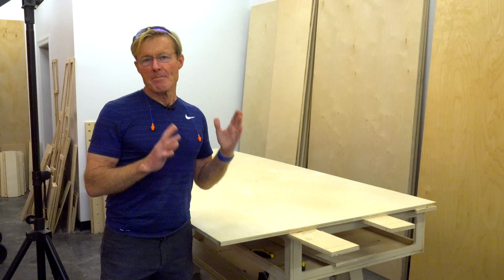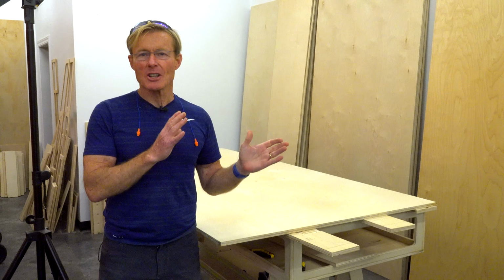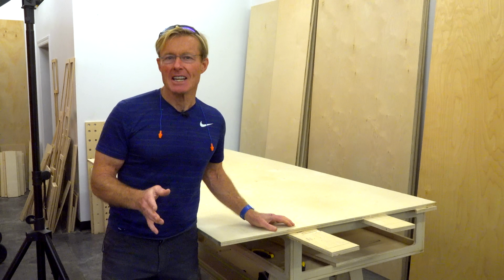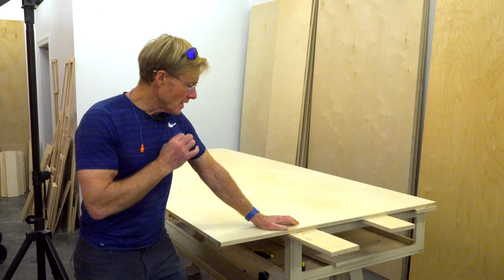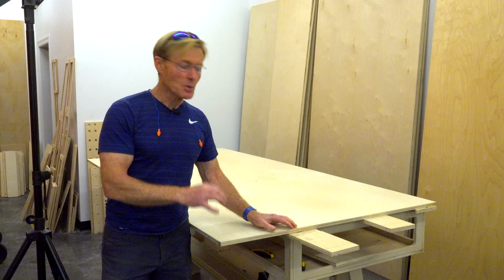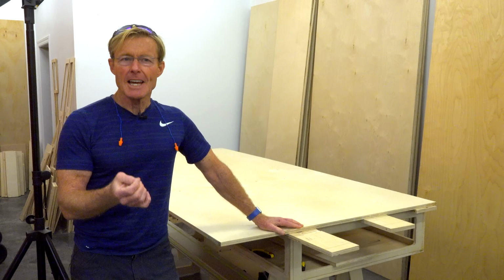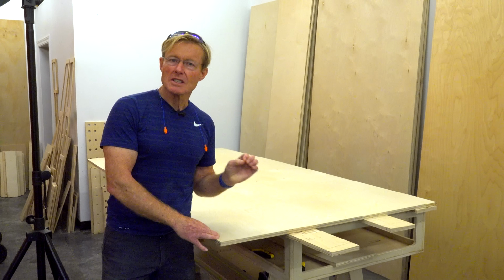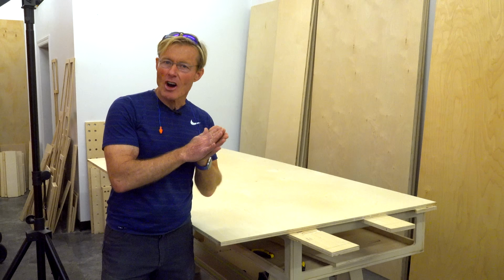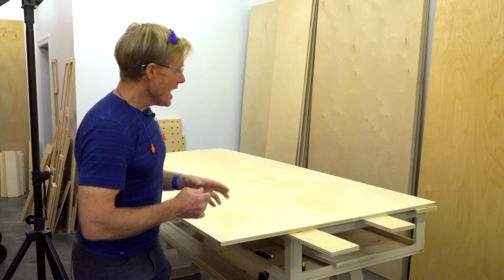I use plywood for everything from framing to finish. And most of the time, all of those framing sheets, it doesn't really matter. I'm using a skill saw, I'm snapping chalk lines, and I get it really close, and it's good enough. But when it comes to finish, when I'm building bookcases or building cabinets or my workbenches, I need to be more critical. I want to make sure the plywood is square, perfectly square, and I want to also make sure that the cut edges are not all furred up, particularly if it's a pre-finished piece of plywood when I'm doing cabinets. But even if it isn't, a lot of times I want that really square edge and I can't really sand it off and bevel it off a little bit, so I want a really clean cut. So I have a number of ways that I deal with it, and I'll show you all of the tips.